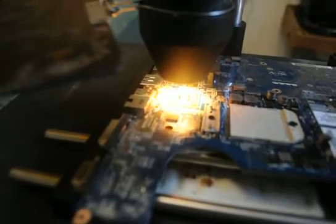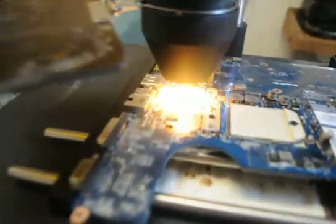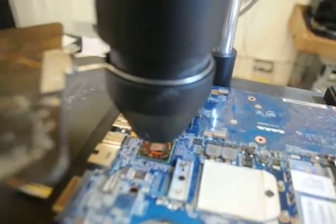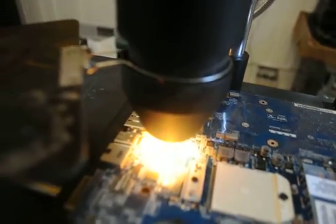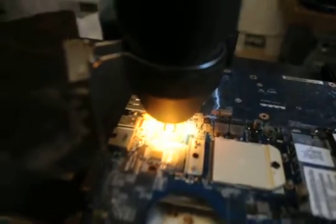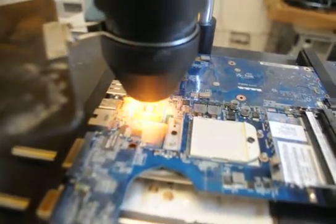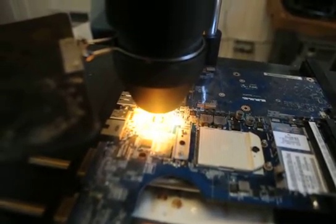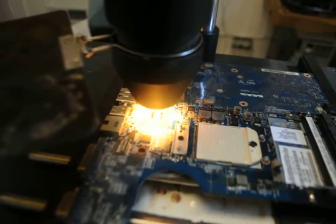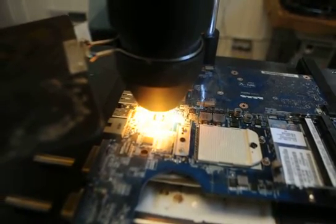You make your adjustments making sure that the light is focused over top of the actual chipset. What this is going to do is physically heat the chipset to reflow the solder underneath it, but not aggressively heat the capacitors that are on top. You have your CPU here that has capacitors on top, and you don't want those to fly off when you're using hot air — that's a major problem. A lot of people say that off-gassing causes the issues, but the major issue is capacitors being removed and power not being able to be returned to the chipset, hence your motherboard doesn't work.